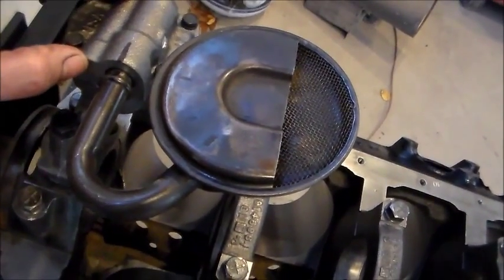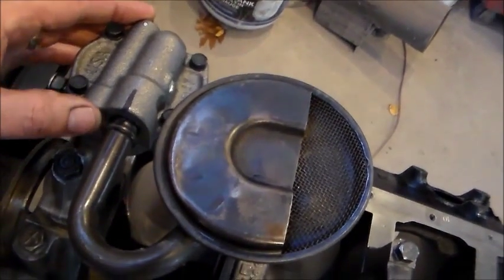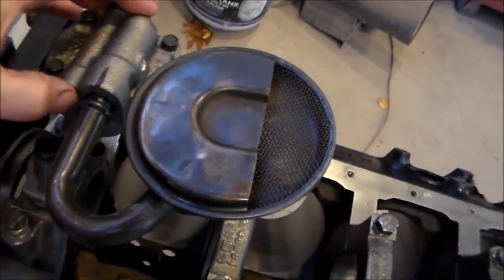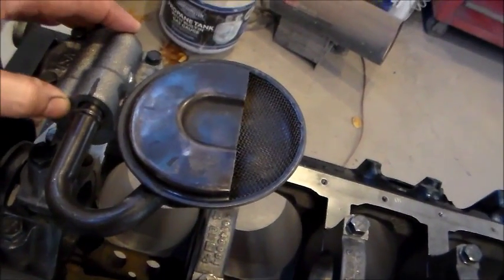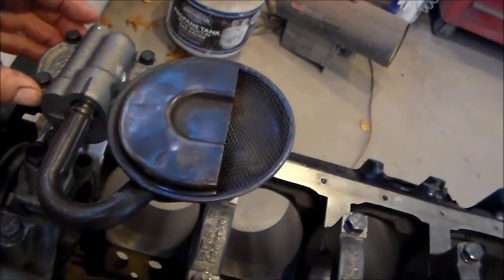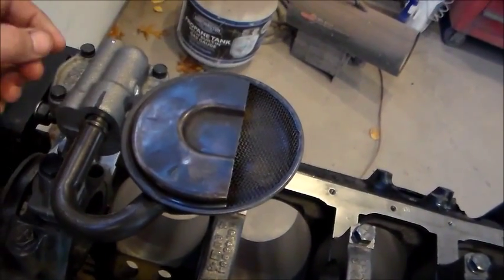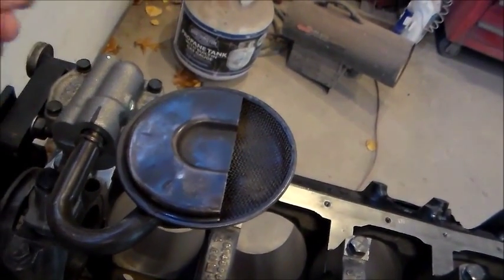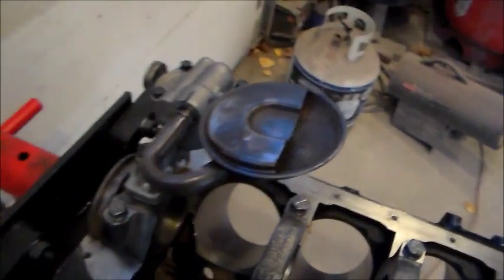I'm going to take this off and drive this thing home so it's all the way in. Some guys weld them — I've never had a problem with one. This is a tapered fit; by the time you bury it all the way down I think it's going to be on there pretty tight. I'm not going to weld it because you'd have to take the whole pump apart. If you weld it with an electric welder, you have a chance of creating an arc between the gears and it puts a marring on the gear, which can cause problems later on.